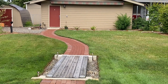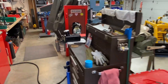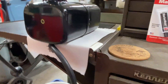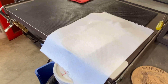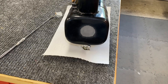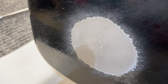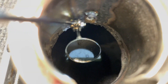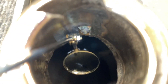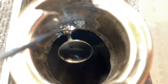It's the next day and we're out at the FUBAR factory to check the diesel tank to see if it's leaking. No leaks. So I sandblasted it, prepped it, and knocked that little hunk off the outside and tried to sand it flat. Looking inside, you can see a dark spot off to the right and some light coming through — so it's not a rust spot, it's definitely from a MIG welder. Probably the wire touched for some reason.